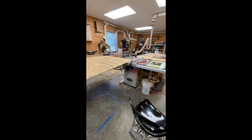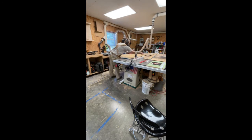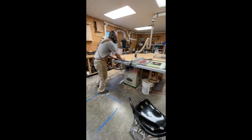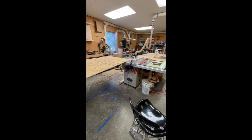Now I am at the shop at my house. The first part of this boat build calls for laminating three long boards together to form the keel. The keel needs to be straight, so I am going to build a grid platform from this OSB material that I can then use as a level gluing surface for the keel.